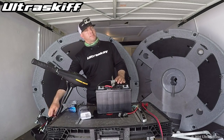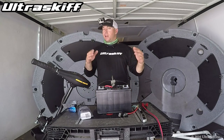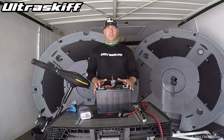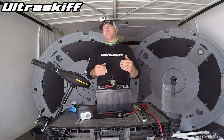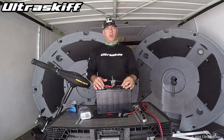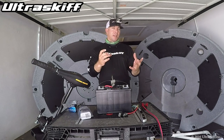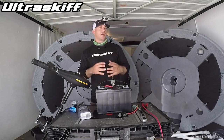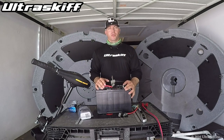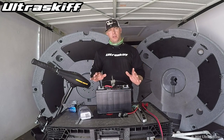My problem with it was just the act of tightening them and the little bit of work it caused. I always wanted to skip that step. So I went to alligator clamps and used them on all my motors the past year, and it drove me nuts because every few weeks I noticed the alligator clamp, after a lot of use, would begin to wear down and become looser. They would lose the grip, and the looser they get, the more heat they generate. If you have a loose connection to your terminals, it can spark and just keeps generating more heat. It's a chain reaction with an alligator clamp — eventually the tension coil or spring that makes the clamp clamp, the heat just keeps changing its structure and makes it less and less of a coil, less tension. Eventually it just destroys itself to where it never has enough tension to keep that heat away and keep it from self-destructing. So I'm done with alligator clamps on these trolling motors for good.